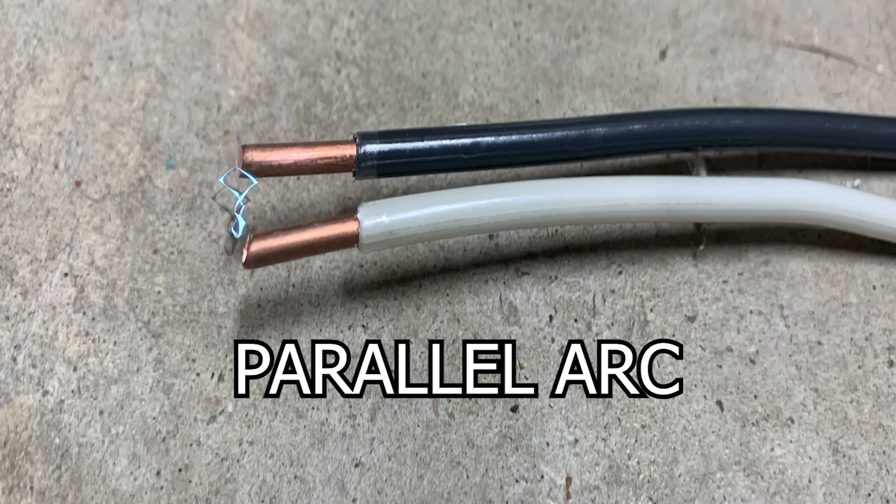The other kind is a parallel arc, and that's where you have a short circuit or a ground fault happening because of an arc. The conductors — a hot and a neutral — may not actually be touching each other, but the characteristics of the circuit are allowing an arc to travel between the hot and neutral, or hot and another hot, or hot and ground. The problem with arcs is they can cause combustion. If you have a sustained arc over a long period of time, the conductors can heat up because arcs are basically a high-impedance event over a very small area, causing enough heat rise that the metal can melt the insulation around the conductor, which can cause a short circuit or ground fault, or cause material like insulation or wood to combust.